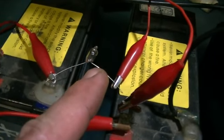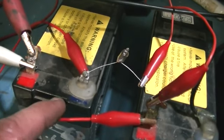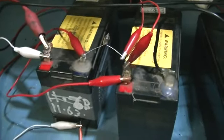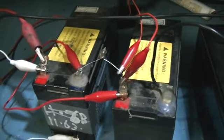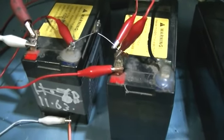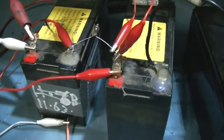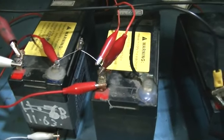They are, like I said, 240 volt neons. So that just goes to show you that I and some others were very wrong. The high voltage does in fact travel through the batteries, and in this case it's actually travelling through two batteries to light that neon up. So Twally, you were definitely correct, and this also gives reason for me to give JB and his work a little more credit than I have been giving him.